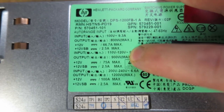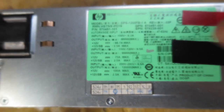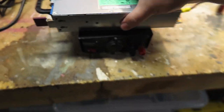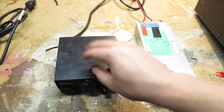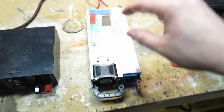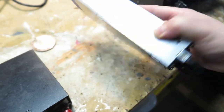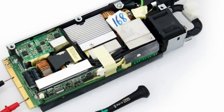At 110 to 120 volts input, it has an output of 75 amps max — that is crazy. The Radio Shack supply is designed for CB radios and has a very small market. This is a server-grade power supply designed to power servers and computers that have to be on, reliable, and clean. What's inside is an incredibly well-designed circuit, and it supplies more than enough power to run an HF station.